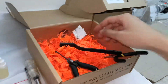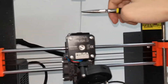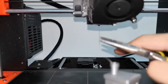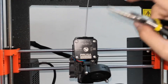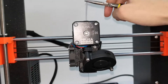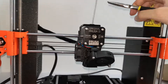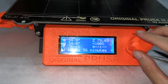Open the idler door, then use pliers to hold the filament. Push it forward manually and ensure filament comes out. This method ensures the nozzle has no partial clog inside. Prusa recommends doing this three times — when it's hot, push the filament through and watch it come out.